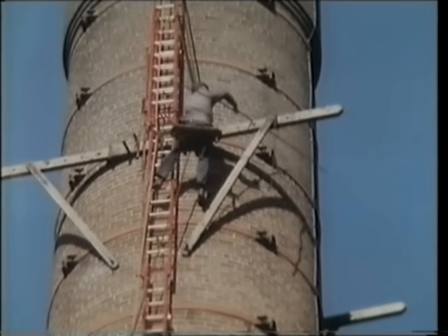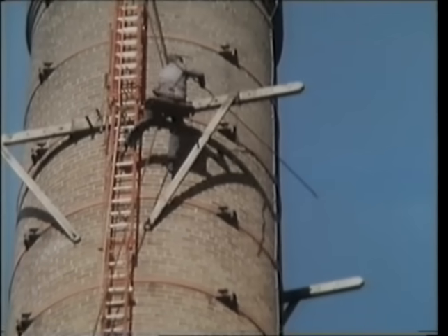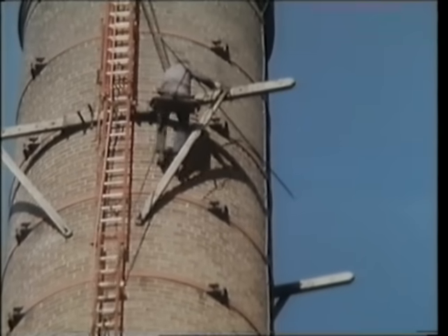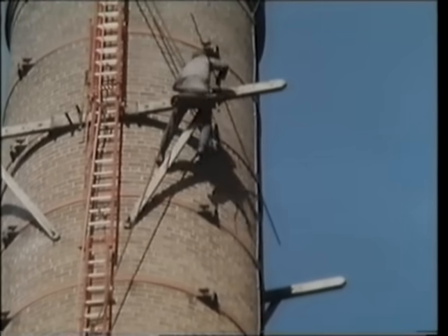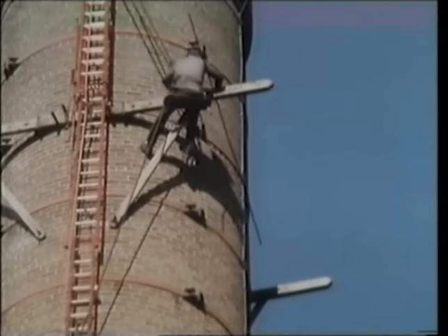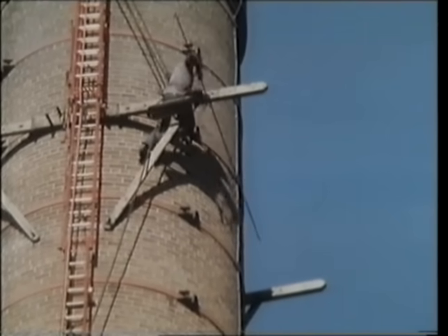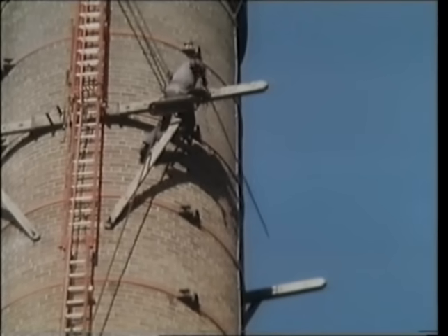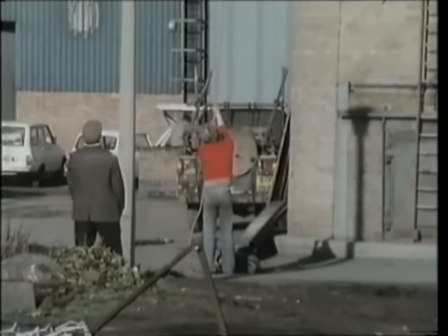When that's been done on both sides of the chimney, the next thing to come up is two long steel rods which I use to connect both of these batons together. I've got this big iron rod and I've got to send it over to the far baton — that means maybe 14 feet across, or 12 foot on a reasonable chimney stack. I've got to get that rod onto the other baton so that it's in line with a hole, and as it scrapes down the face, give it a shove through the hole. If you're lucky you'll get it through — it's rather a tricky bit.